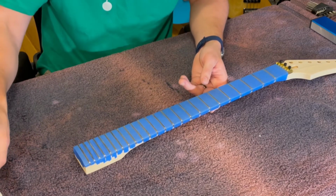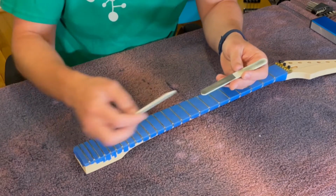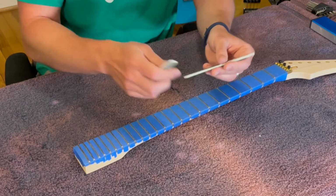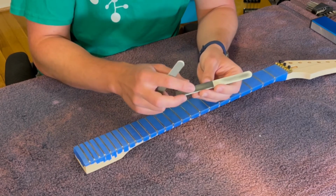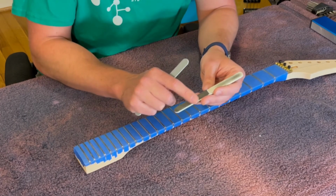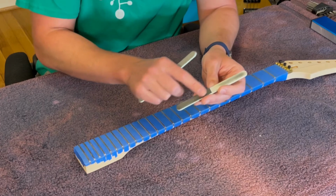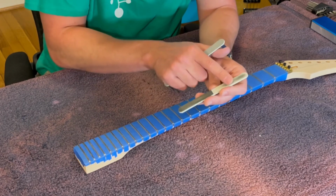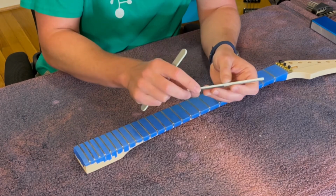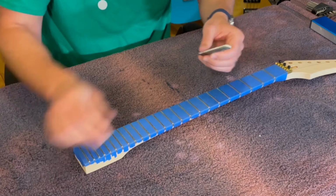And the last thing that we're going to use are some of these sanding emery boards. These particular ones I got at StewMac, and they're not sponsors either, but they just happen to be very convenient. What they are is a series of different grits of sandpaper, and I forget off the top of my head specifically what grits they are, but they've made them so that it's the 3 grits you need to basically finish off and completely polish. The black side is the most coarse, then on the other half is about a medium in terms of the 3 grits. So this is the coarsest grit, this is the medium grit, and then the entire backside is a very fine grit.